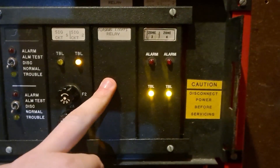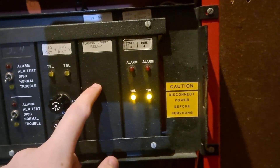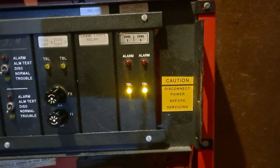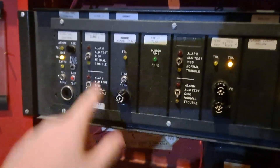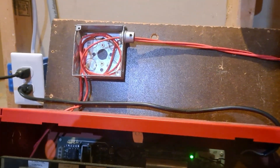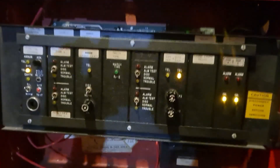Right here is a relay card. It's not functional, but there are two relays mounted to this card, so that's pretty neat. And finally we have another dual zone card, both zones having troubles on them. These aren't connected to anything. In fact, the only zone that's wired up is zone one, which goes to the 4251-20. I've been thinking about adding a heat detector to this loop, but I don't have any time-accurate Simplex detectors to put there, so I just leave it empty for now.